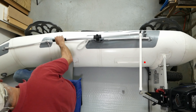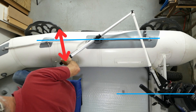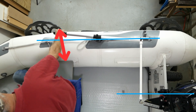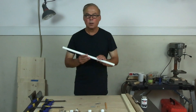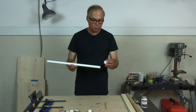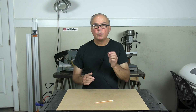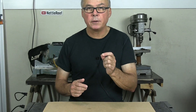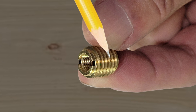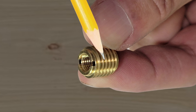The first part to make is the tie rod. With the motor centered, we'll make the tie rod length slightly longer than the center line of the tube. This will bring the steering arm end closer to the driving position, shortening the steering reach. I decided to make this out of PVC pipe — it's strong enough, lightweight, durable, and cheap. To attach the tie rod ends to the tie rod, we'll use threaded inserts. They're threaded on the outside like a wood screw, so they can be threaded into wood or other materials like PVC pipe. On the inside, they're threaded like a nut for a bolt, or in our case, a tie rod end.